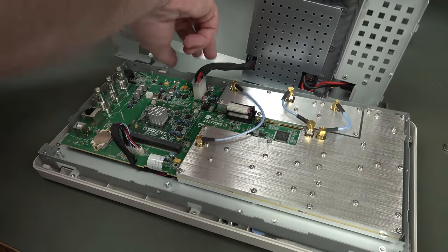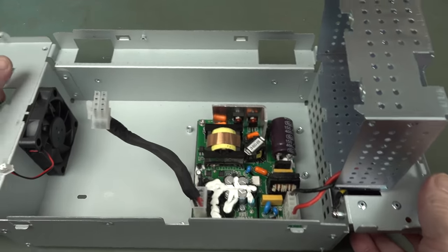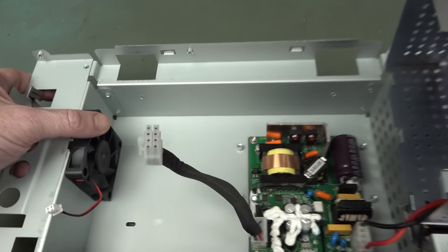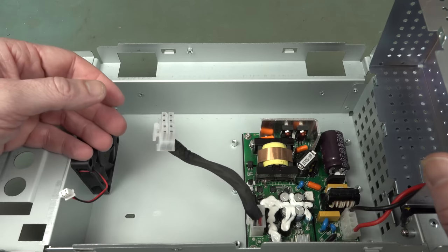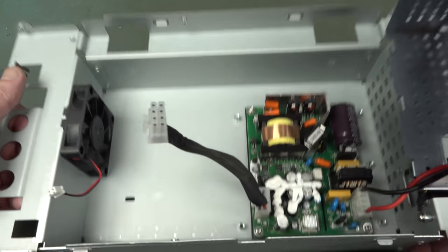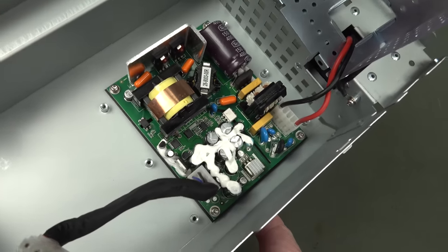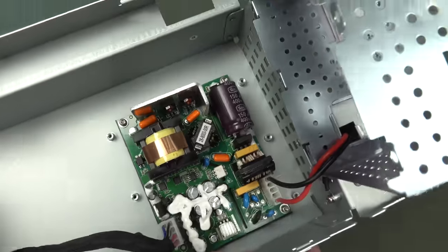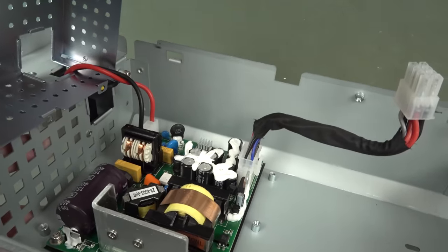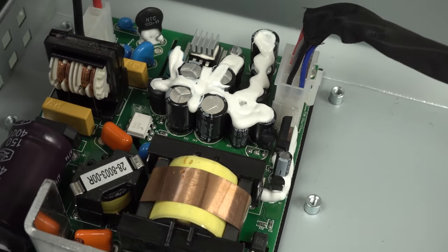We're in like Flynn. We expect our machined aluminium complete block for the spectrum analyser section. Looks like we've got a tracking gen down there, and we'll have one of the directional couplers down in there. That's looking pretty sweet. We've got a separate little processor board here. There's a little fan - a little bit of noise but nothing really offensive. Airflow goes directly over the network analyser, and there's a little heatsink on the power supply. Main power supply is down in here.